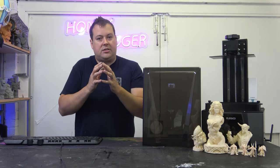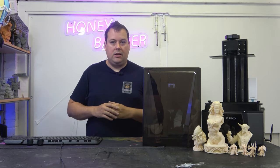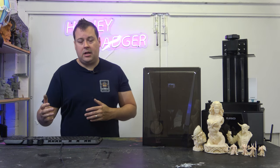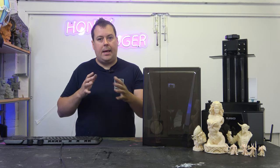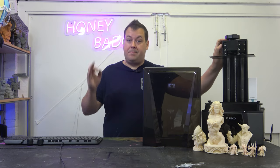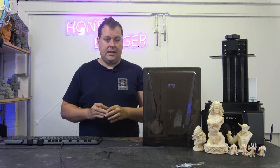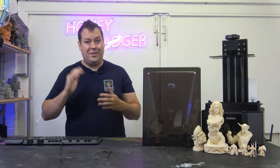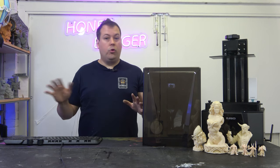With that pixel density comes some real flexibility when it comes to speed. We've covered a few different machines on the channel recently — the Apex Maker, the P13, and the Mini 8KS from Frozen. What we're seeing more and more is very similar to what's happening in the Core XY market in FDM: we're at the stage where quality can't get much better than it is. Everybody printing in resin for best quality is either printing at 0.05 layer height, or in some cases 0.03 for really fine details. The pixel density, those microns, are what matter for quality. We are very rapidly approaching a point where we're getting all the quality that we need.